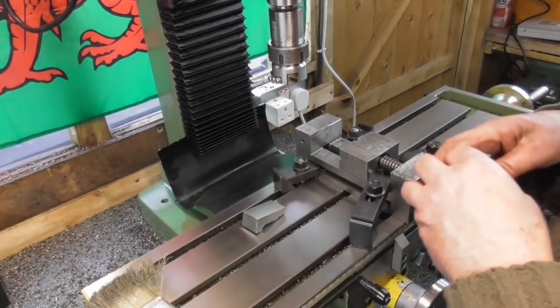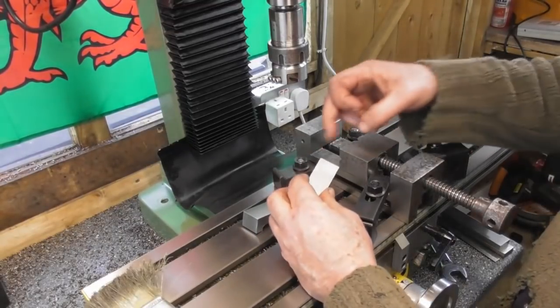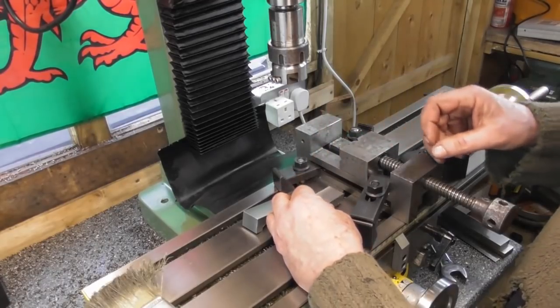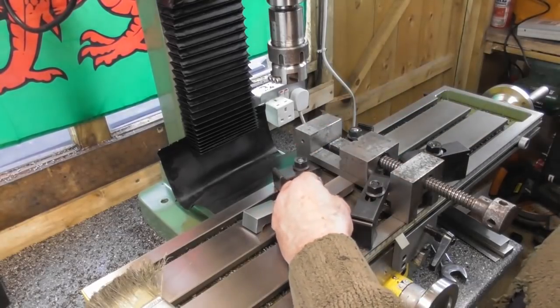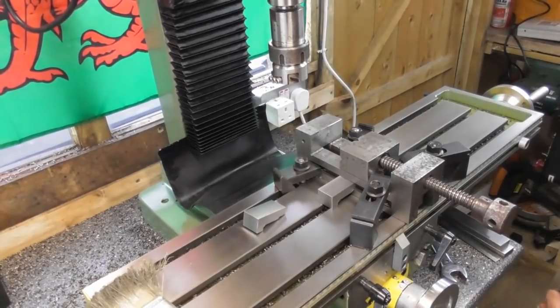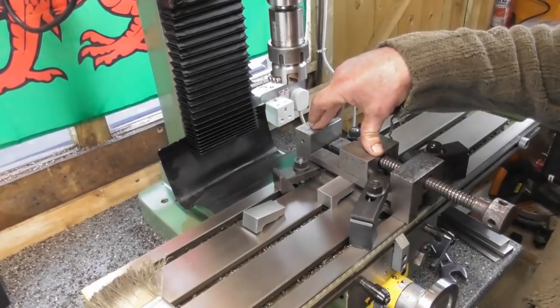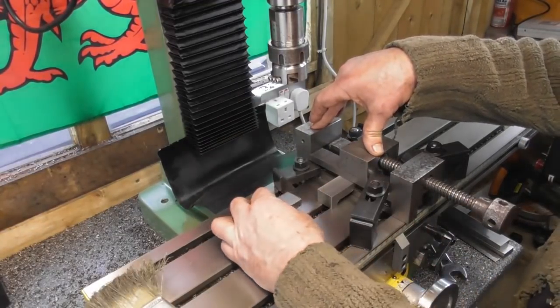Yeah, and as I said, there's 2 of them. They both need deburring. I probably will chamfer the top edge and the front edges. Probably put some nice 45s everywhere, and then they'll be chemically blackened or blued or whatever you want to call it, and there'll be the 2 dedicated clamps for this vise. I may make some more of them at some point, but at least I've got something to go on, and it was a nice little first job, I think.